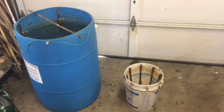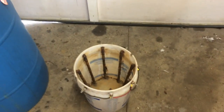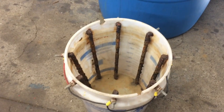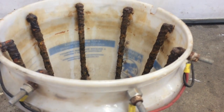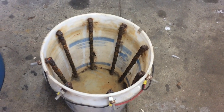Here's an example of a couple of electrolysis tanks I have for getting rust off different types of parts. The first one I made was a five-gallon bucket — you can see there's rebar all around it. Electrolysis only works on line of sight, so if you just had one bar in the tank, only that one side would have rust removed. With 360 degrees, it gets the whole part. The rebar is welded to a bolt and nut on the outside, all daisy-chained together to make one contact point. A piece of rebar hangs along the top so you can hang your part inside.